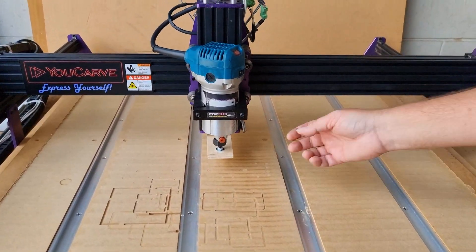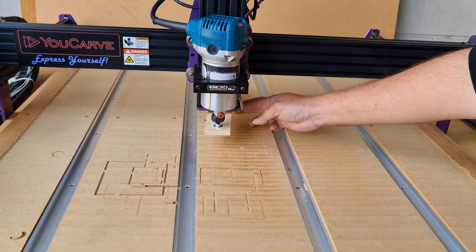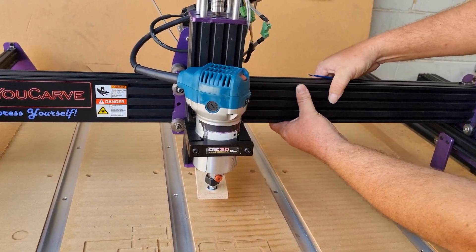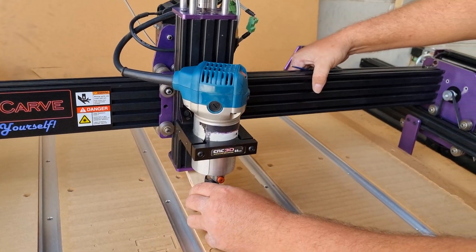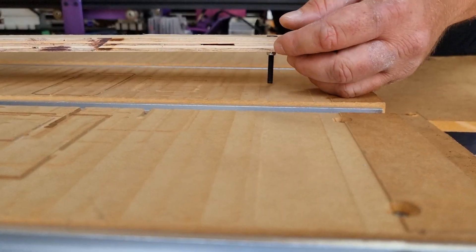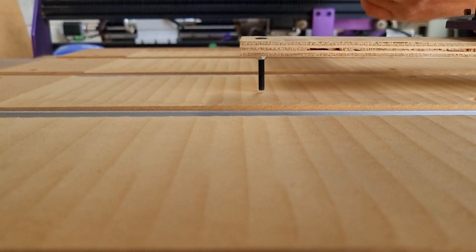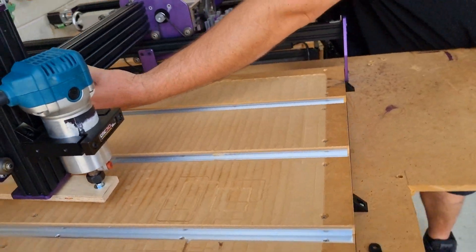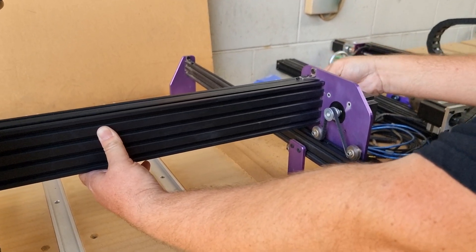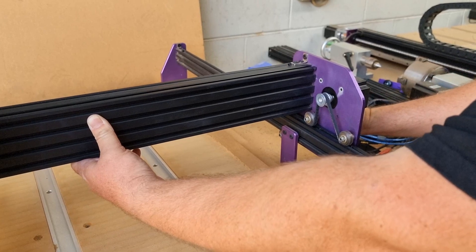Now we can rock our gantry into position. We'll swing the arm back to the front — we know the clearance there was very close — then check the back where we still have that small gap. All we want to do is grab the gantry roughly in the middle and give it a bit of a twist so it's very close on that side. Holding it in position and rolling the arm back to the front, we've got roughly 2mm there. Swinging back to the other side, we've pretty much got about 2mm there as well. While holding the gantry in position, we'll re-tighten the bolts.